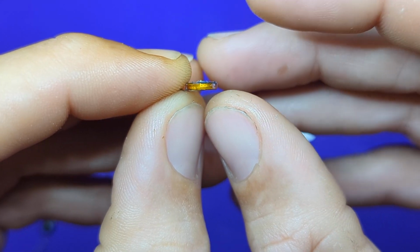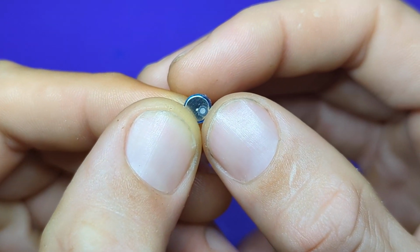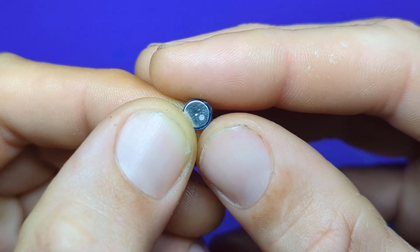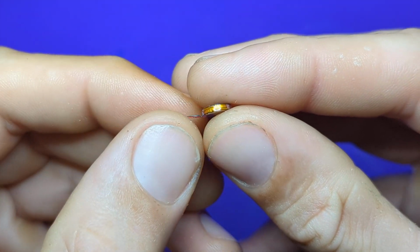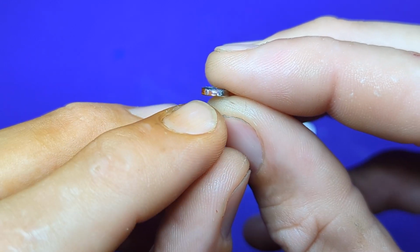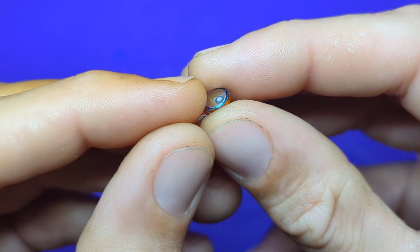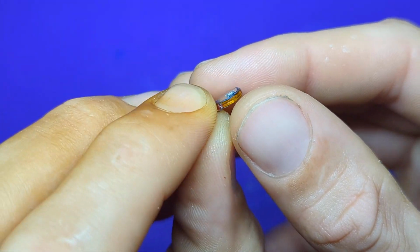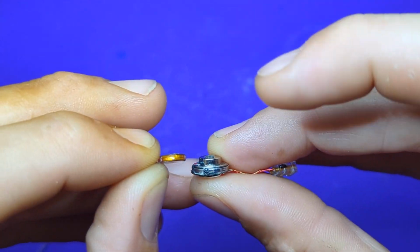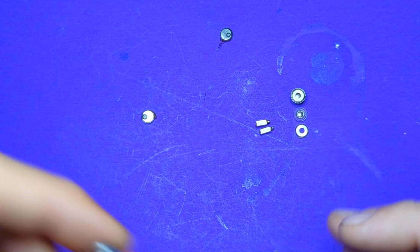I mean, it's only like 1 millimeter thick. And so you have a little dust cover or a little mesh on the top that's just, in my thoughts, to keep dust out. It could be for tuning purposes, but I don't really think so. I think it's more just to keep dust and debris out, keep the driver clean. And then you have this little flex PCB ribbon. Now that's just to carry the signal across to the input side, where the two terminals go into the driver itself. Okay, and yeah, so that is the flat panel driver, and if you look at it head to head against the QDC driver, they're about the same size, so not much different there.